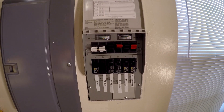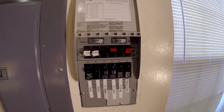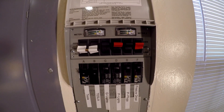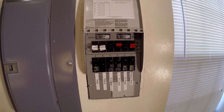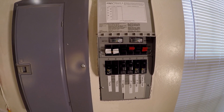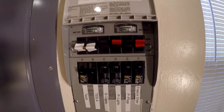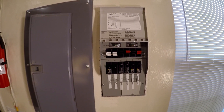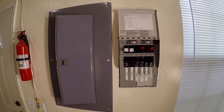The plan is to run it on solar all day — it's about 8 o'clock in the morning right now. I'll probably run it a little bit into the battery, and at some point we're going to switch that over. I'll wait until the freeze dryer is in a mode where it's pulling less power — so the heaters are off and compressors are off — and that's when we'll switch it. Hopefully it'll just continue right on, and then tomorrow morning we'll switch it back to the solar again until the cycle is done.